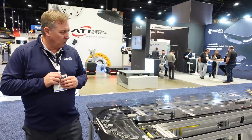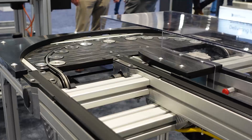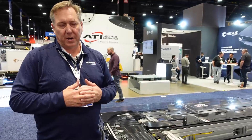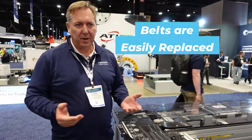In addition, this shows a longer run of our belt system. These are tooth belts that come sized to the conveyor. It keeps your downtime down so that you don't have to weld a belt — you can just replace the belt if a belt breaks.